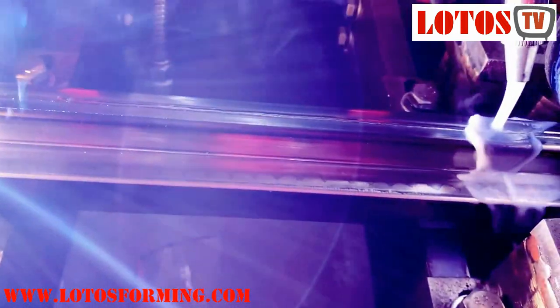These technologies can be divided into two groups, fusion welding and forge welding. GTAW and laser are fusion welding technologies, relying mainly on heat to fuse the material. HFI is a forge welding technology, which uses a combination of heat and pressure.